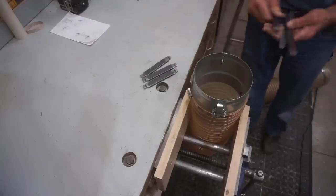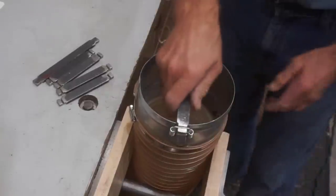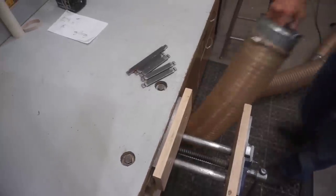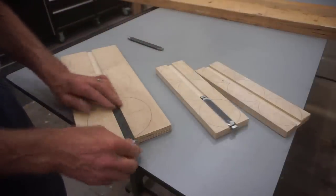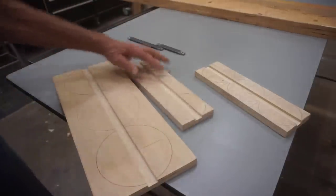With fabrication completed on all the bars, I give them a quick test fit on a six inch QD fitting to make sure everything is as it needs to be, and it's a firm, reliable attachment. I ripped some pieces of three quarter inch thick Russian birch plywood and then plowed three quarter inch wide by one quarter inch deep dados in them so that the clip bars fit flush and snug in the grooves.